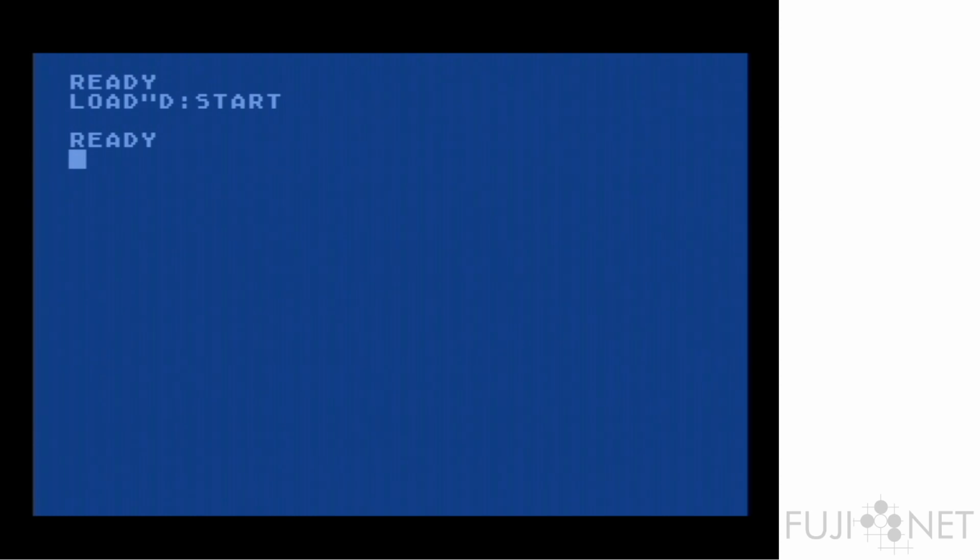It provides the real-time clock, it initializes the 850 handler, and does the bootstrap, and then loads start. So you have to use that. Well, this causes a number of issues because we need to be able to do things like rlisten to specify a listening port, and we need to be able to run the rAutoAnswer tool to automatically set the auto answer mode to enabled.